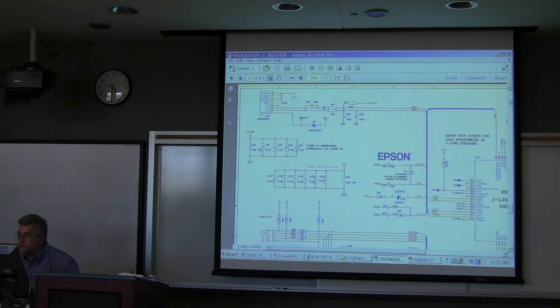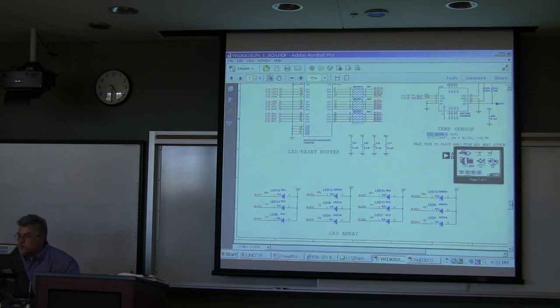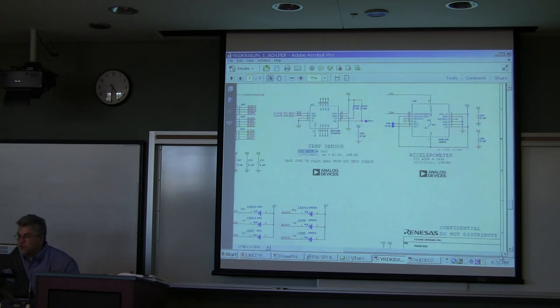Where did it go? There is also, oh, it's a little bit further this way. The accelerometer is something you communicate with via I squared C as well. So notice that the I squared C address, this is important for the homework assignment, 3A. So if you communicate with the accelerometer, you can just look at some of the code that's in the book. And in this case, you want to communicate with and send the address 3A, and that will be the one that will respond.